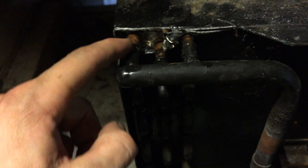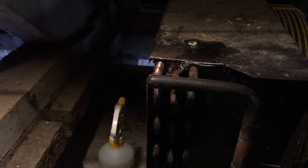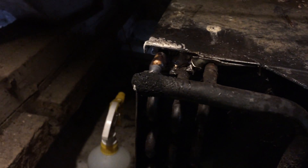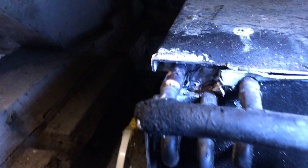So if we clean it up and just braze all around it, then we'll pressure test it. Right, I've got that all cleaned up, so we'll go around and braze it in. That looks like it should have got it — I've brazed all over the pipe and all around the case, it's got quite a blob under it.